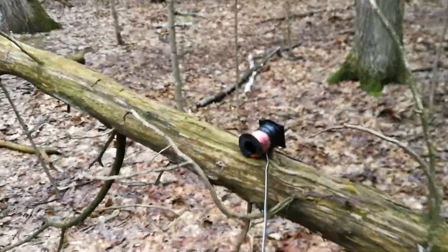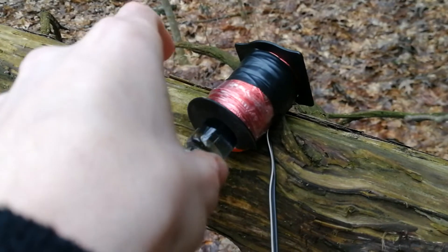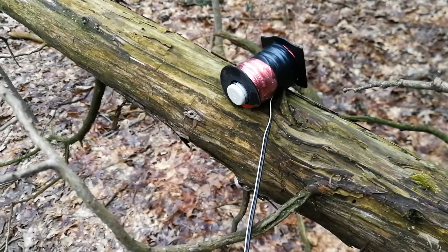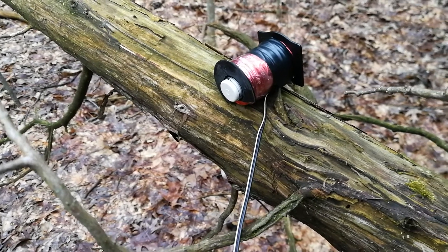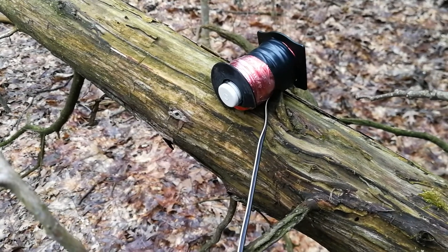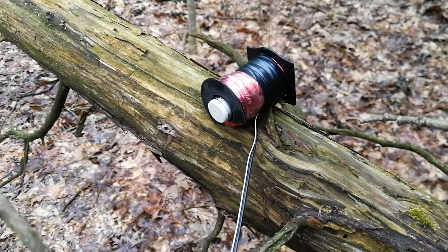In order to do that, I'm going to place this sample into an induction coil that I have over here. The coil is oriented east-west, so if I pass a current through the coil, I should polarize the protons east-west. Then when that current is interrupted, the protons will precess back to north-south, and in doing that, they'll emit some energy in the form of a transient tone that can be picked up by an amplifier.